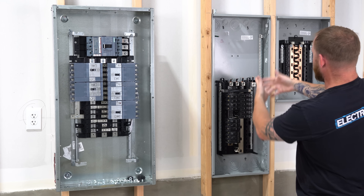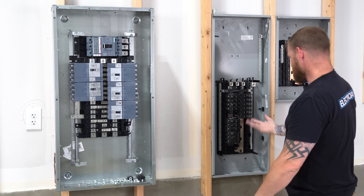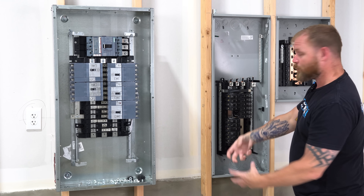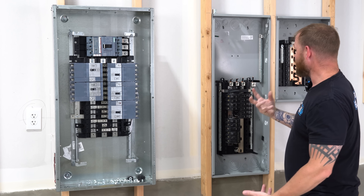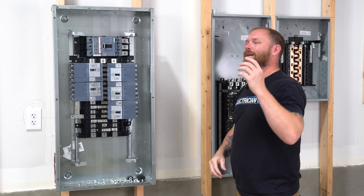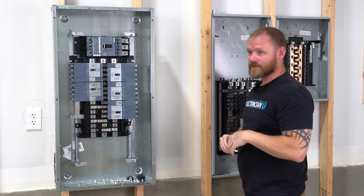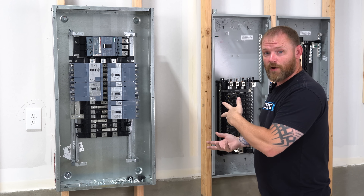So if you were to go to Home Depot, you're probably very familiar — this whole entire thing pre-assembled comes together. Sometimes it has breakers, sometimes it doesn't, but you pull it all out of a box. It's manufactured together as a load center. Load center is not a code term. It's more of just a marketing term — how they distinguish between a lot of these commercial and industrial products versus largely residential products.